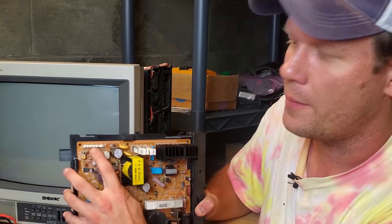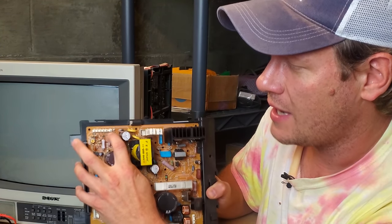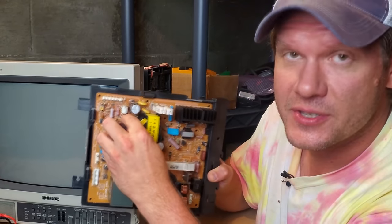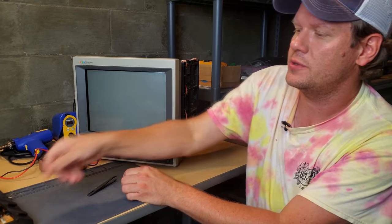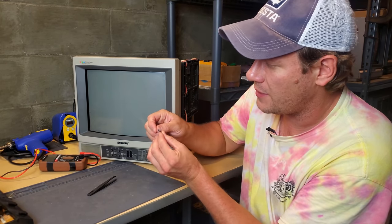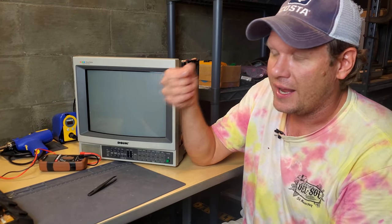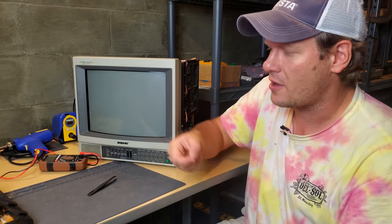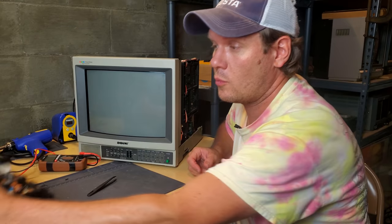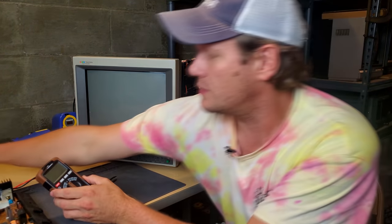The second fuse is up here where the power actually goes out of the monitor, at this connection point right here. And you have 115 volts coming out of this monitor, so there's a fuse right below that. It's not installed in this board - it's been removed because I'm going to use this fuse to hopefully fix our broken monitor if that's the problem. Now, this is an 800 milliamp solid fuse. This doesn't look like the other fuses - it's just a solid little component. And if it blows, it does have to be desoldered and then re-soldered into place, so it's not nearly as simple to change as the other PVMs.